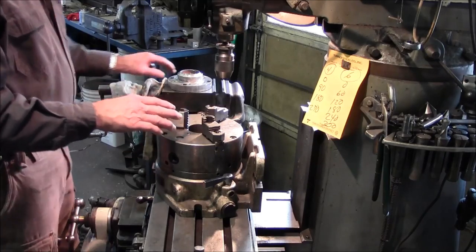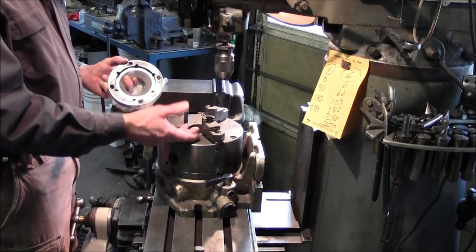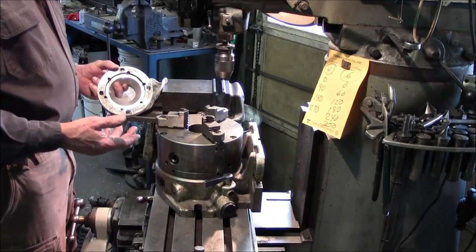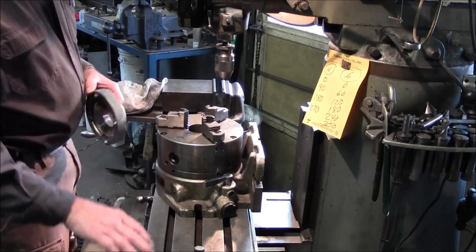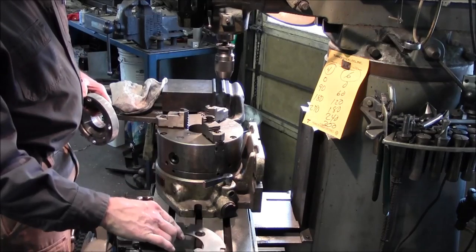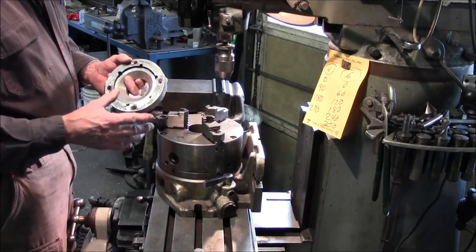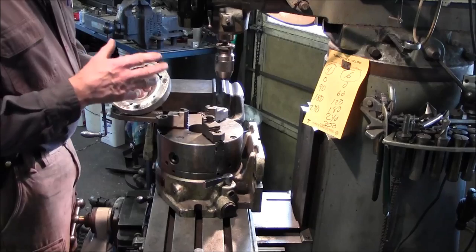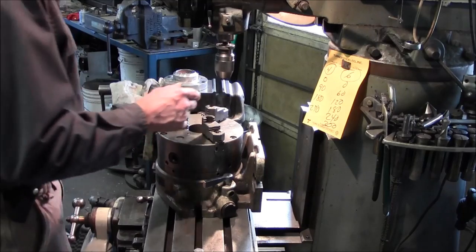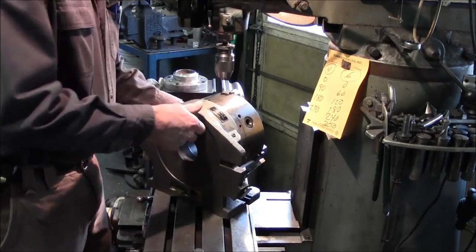All right, we're getting ready to set up the dividing head or super spacer, more commonly known as a super spacer. And normally when we go to set this up, we would set it up with a masking plate. And a masking plate, I'm going to show you where these go and how they're used to configure for one hole pattern, either quantities of 6, 4, whatever your hole pattern is. The only thing the super spacer won't do is the combinations of 5, okay? That's the only downfall on a super spacer, is increments of 5 or 10.